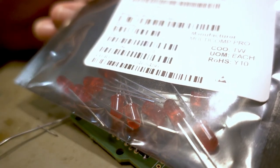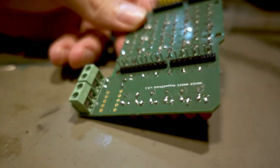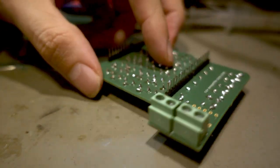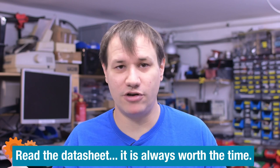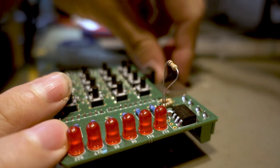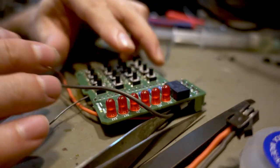Plans don't always work on the first try, especially if you didn't read the datasheet correctly. Solid-state relays only work with AC on the load side — if you put DC in, they don't deactivate anymore. Good to know! So I'm switching out the solid-state relay for a normal relay that works with 3-volt logic levels. I've used that before in my Raspberry Pi Super 8 camera build — still got one, so I put that in. I designed in that fallback just in case, so we can activate that relay with our software.